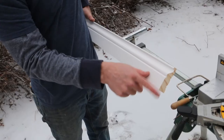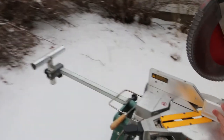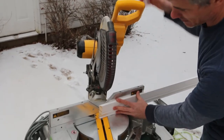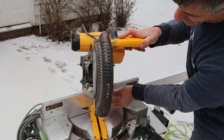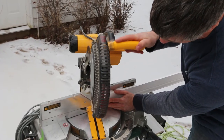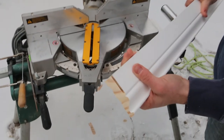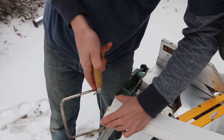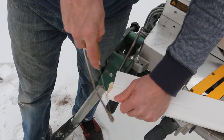On something like this I wouldn't cut the whole line with the coping saw. I would take this piece, flip it over, set the miter saw at about a 20-degree angle, and trim just down to where the profile starts. So I take that first inch and a half and cut down right to where the curve starts, then snap that off. Then I switch to the coping saw — on this piece it's going to be a little more involved because there's a really tight corner.